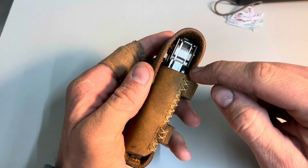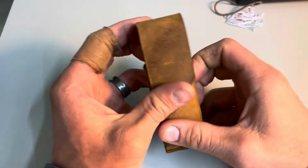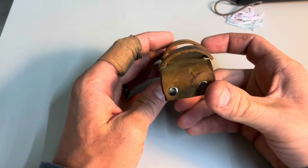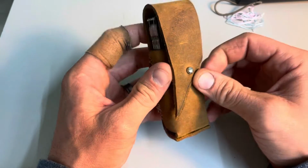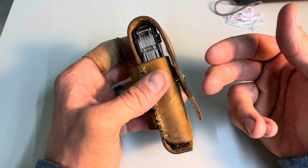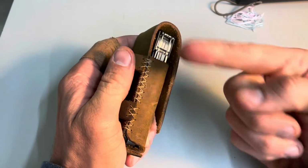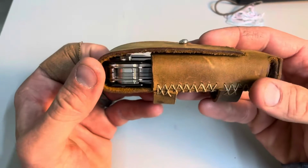You can improve it even more by putting some wax on there, like candle wax. You rub it on there and then you burnish. I have a little attachment that I built for my lathe, and really anything you can do to motorize the burnishing process, whether it's to put it in a drill chuck or drill press or something like that. Burnishing really happens as a function of heat, and that heat comes in through friction, and you'll get a lot more friction if you're not doing it by hand, but with some sort of rotary motorized thing. So yeah, that's how I like to treat my edges.